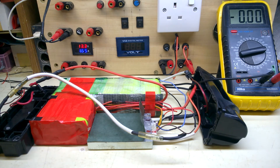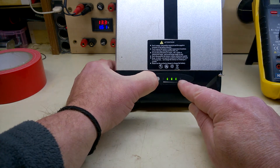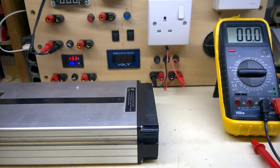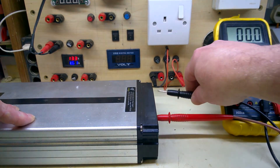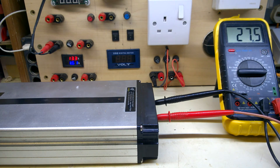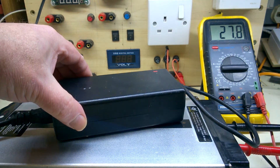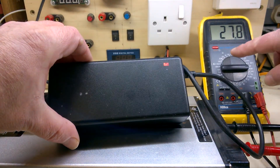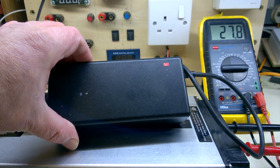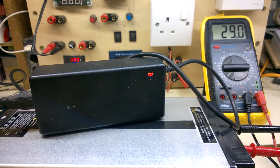So let's put that back together. That's it back together. I seem to have lost an LED — I'm sure this one wasn't lighting previously, and now the other side isn't either. Let's check output voltage. 27.5 — that's after the discharge of course. Let me try charging it. Charging confirmed: the voltage has gone up. Let's put a voltmeter across it, hook the charger up, and see the voltage increase. It's charging; it's not quite full.